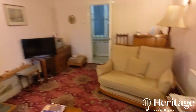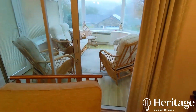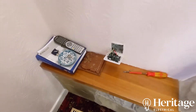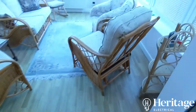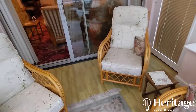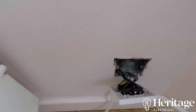This circuit covers the utility room and the conservatory. The first thing I did was try removing this socket to see if the conservatory supply had been tapped off it, but that's already a spur. Previously the gentleman mentioned there'd been a problem with this heater, and this is on the circuit that's got the problem.